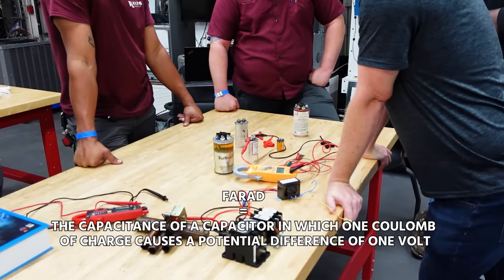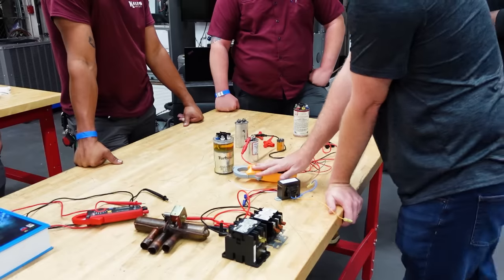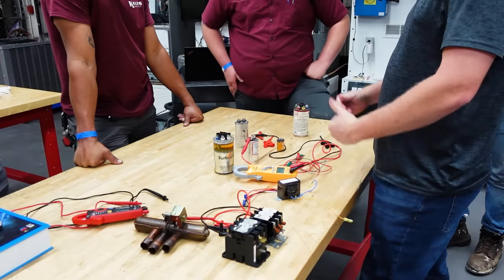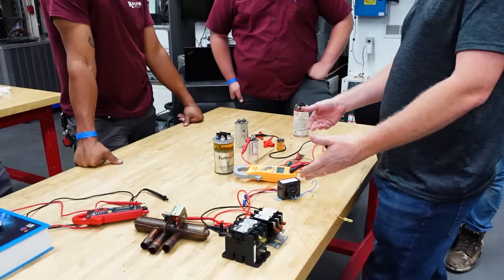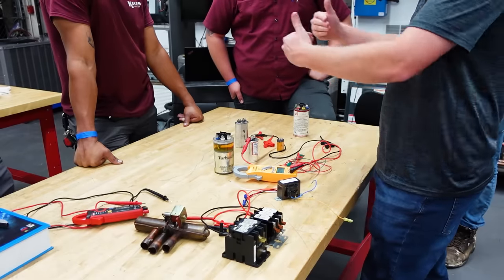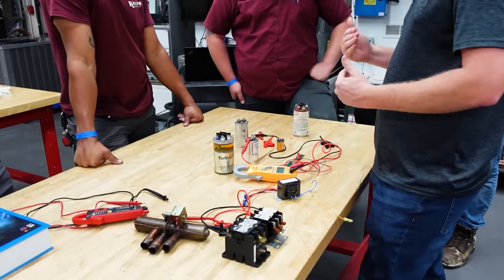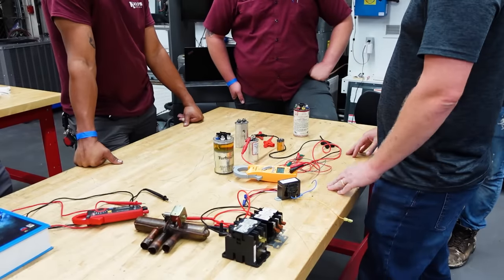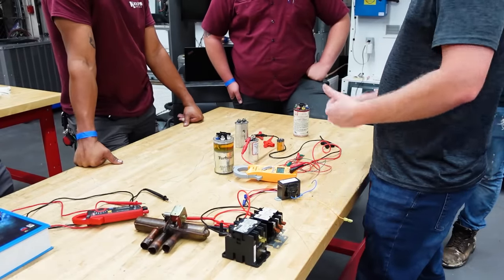amount? It's just looking at, because this meter knows how much potential it's giving, how much voltage it's giving, and it's a very low voltage. We just measured it, right? And this meter is less than a volt. So it knows how much voltage it's giving. It knows how much pressure it's giving. And it knows how much current it's taking at that pressure. So it can charge and discharge that capacitor, and now it sees how much energy.